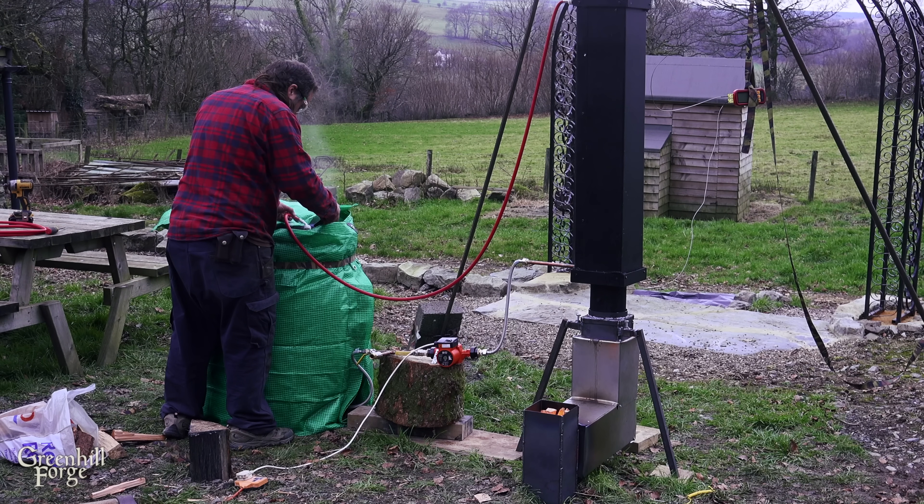I think the rocket stove was just too powerful for this heating coil design. It used about the same amount of wood as the traditional wood stove but converted it to heat almost twice as fast, meaning it was almost twice as powerful. This allowed the water to get just too hot for this setup, including boiling the water several times and creating unsafe temperatures and pressures. That's not to say a rocket stove wouldn't be great at heating water — with their high efficiency rate they're actually perfect for this. I just think the water heating system should be further down the line of a rocket mass heating system, after the flue gases have passed through more stable matter like cob, clay, or sand and brought the temperatures down to a more manageable range.